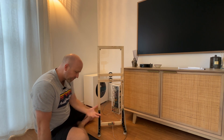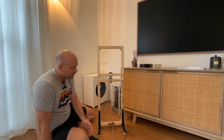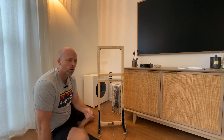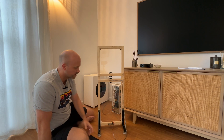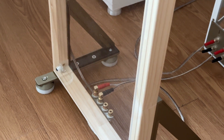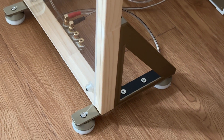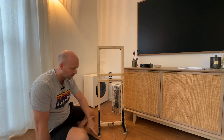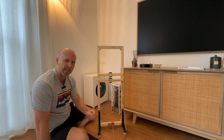The brackets were originally 3D printed in PLA — a rigid plastic — which I think is strong enough since I don't have kids or pets knocking things over. But I added right-angle steel brackets for extra strength and, importantly, more weight at the bottom so the speaker won't tip if bumped. I've also 3D printed feet in PLA for the structural part and TPU for the actual foot contact, which is a softer, slightly gummy material for isolation.